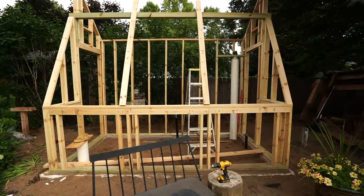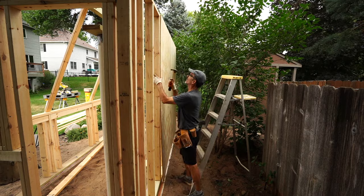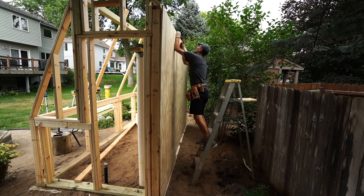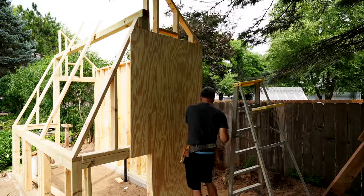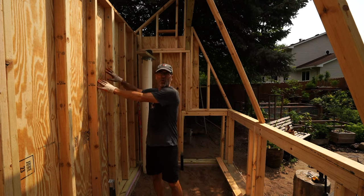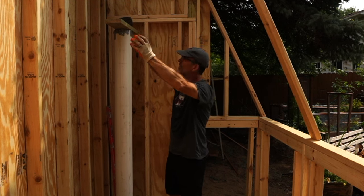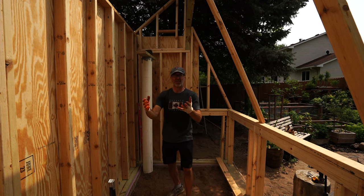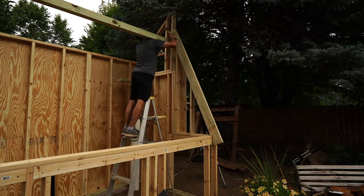Welcome to Dave's Bonsai. On today's episode — passive solar green frame part five. This morning I got supports on the back and east side using 5/8 plywood, smooth on the outside, which I'll paint or stain. I put in the east wall, traced out holes for the window, and cut a corner nub. We're building a greenhouse and cold frame: the south side is all windows, the north wall is all insulation to retain winter heat. Hot air from the greenhouse will go down to warm the rocks, then circulate back up to keep the cold frame from getting too hot.